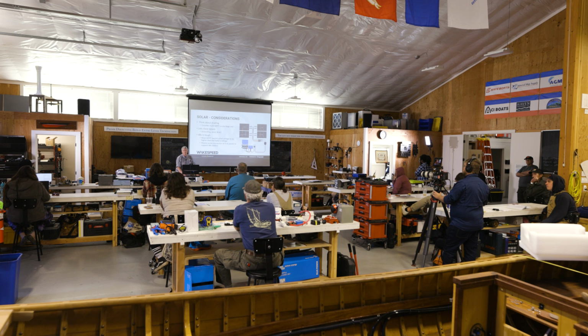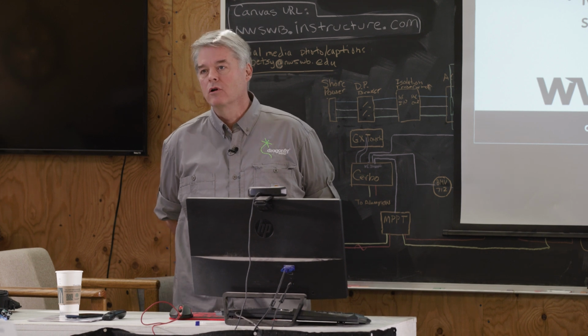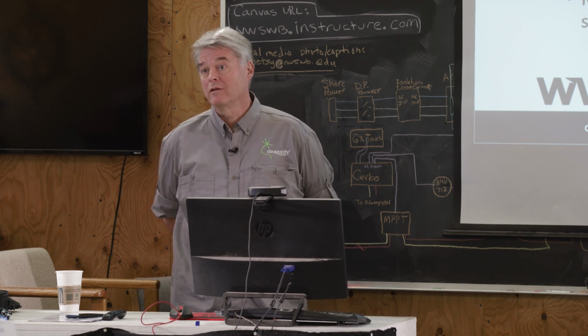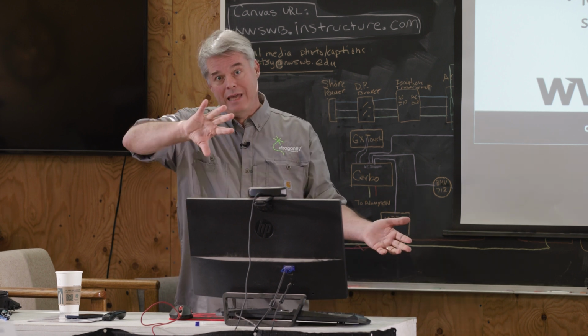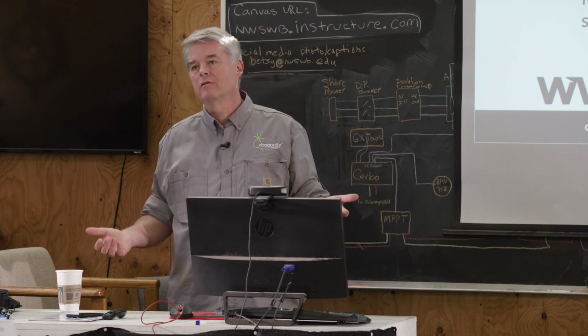On that specific hurdle, is there a way to configure a solar array and one or more controllers and then go to a DC to DC converter? There are a couple of solutions, and we're not focusing on these, but one solution, I mentioned this product called the Wakespeed 3000. It is a bidirectional converter. So what we would do in this particular case is have people connect their solar panels down to a 12 volt battery, and then have that converter pull energy off the 12 volt and up to the 48 volt side. That's how we solve that particular issue.